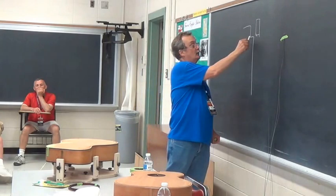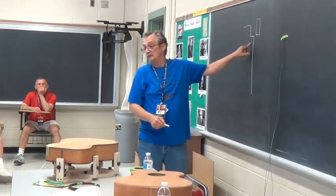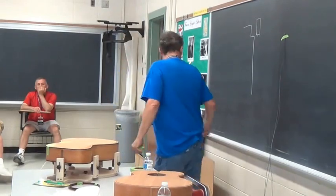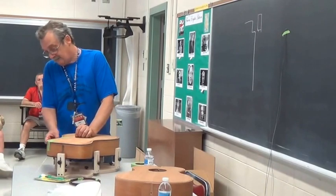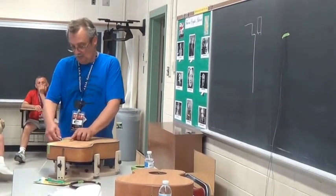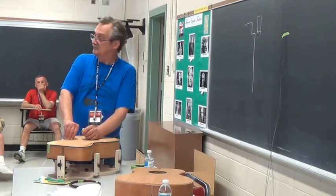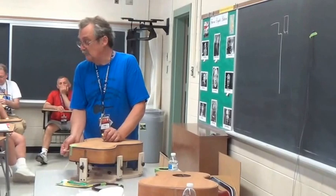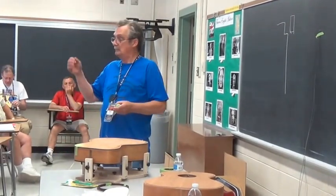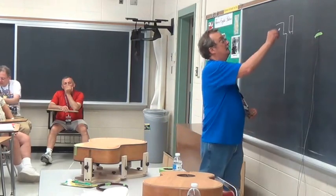That way you are going to maintain your contact to those two points. Now, it's not uncommon for you wood binding guys to have some gapping. I do all of my wood binding at 65 thousandths, and I set my route cut so that I'm about 70 thousandths. I want my route cut so when I put my binding into the route cut,